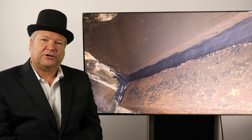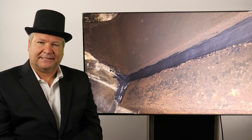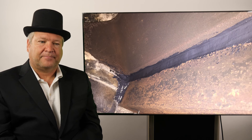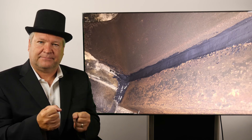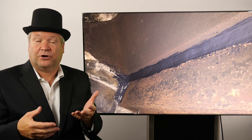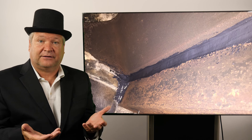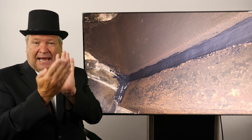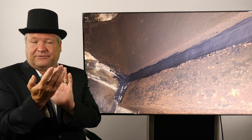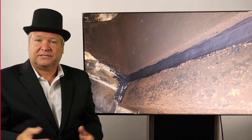Sometimes you'll wonder: if it cracked once, is it going to crack again? Nine times out of ten, it doesn't. Here's why. Your home settles and your chimney settles — it usually takes between three to ten years to have your home completely settle, and three to ten years to have your chimney settle. Both of them have settled differently and it's caused these gaps. It's after ten years that you can fill it up and they're not settling differently anymore. And it's through.